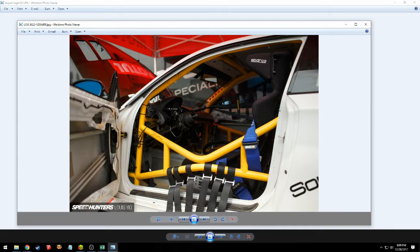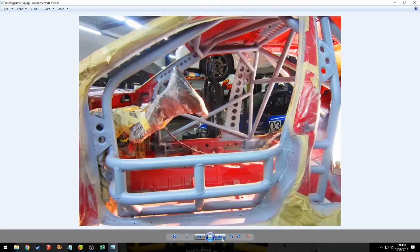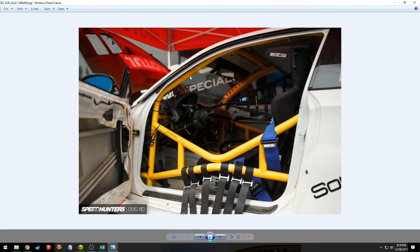I'm thinking I'm going to copy some of this one. I also want to take a piece from this style where you have this extra little pillar support — it doesn't block your view because you've got your mirror piece. If we add that section onto this car, we'd have an extra little pillar coming down, catching into this node here and just triangulating that. It looks like a good place to strengthen things up — adding a little extra gusset and so on.